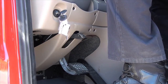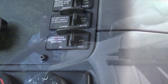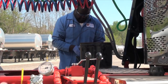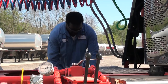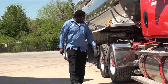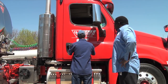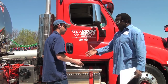In the cab, press the brake and set the PTO switch to out — the engine idle will drop. Gather all of the hoses and secure them in the storage tubes. Store your drip pan and bucket in the appropriate storage compartment. If there is no lid for the bucket, place absorbent towels in the bucket to cover any product. Clean up any spills or other debris left by the process. When finished, verify that the customer is satisfied, have them sign the weigh bill, then thank the customer and wish them a wonderful day.